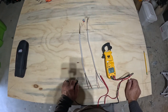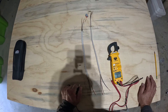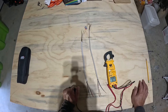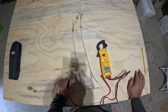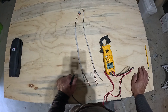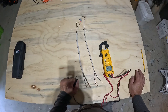I hope this was short and useful — I just wanted to provide a little trick on how to identify your sets of wires coming into boxes. Sometimes you need to identify them whether you're wiring three-way switches or whatever it might be, and you need to identify your power sources from the light, fixture, or power source itself, so you can place those wires on the proper terminals. The easiest way is to shut off the power, tie the wires you're looking to identify together, and then by process of elimination test all the wires in the secondary box — when the meter beeps you'll know which wires you're looking for. I hope this helped and I'll see you guys on the next one.